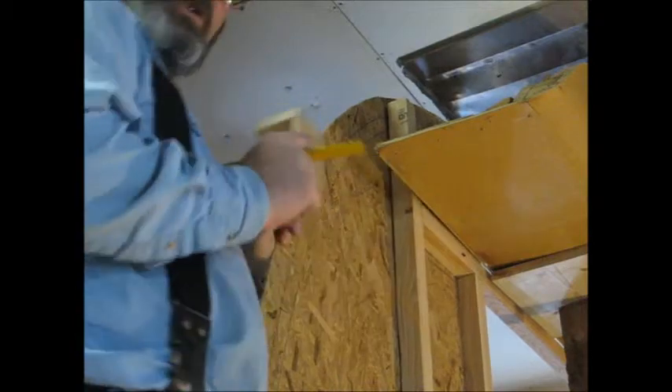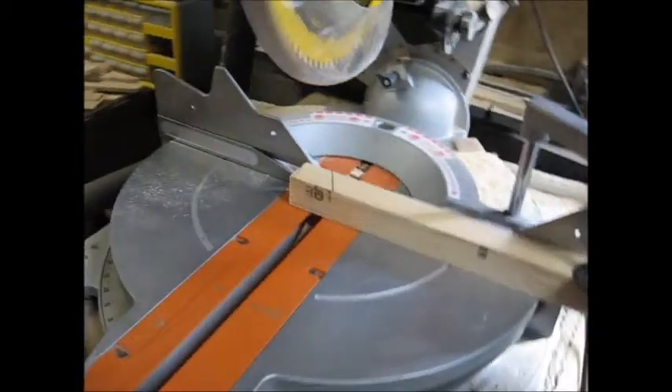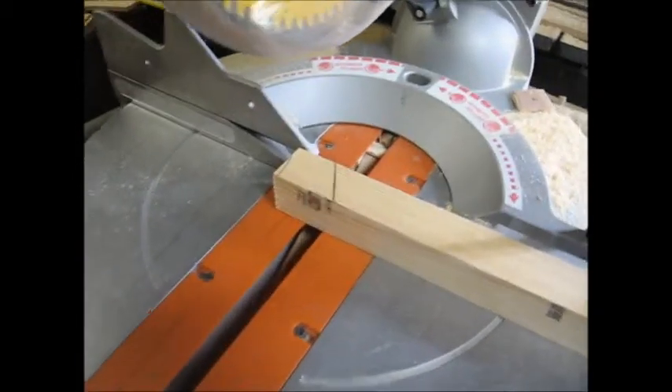I put this stud in — I just got it clamped into place temporarily. We'll mark this angle on here off our pattern, and we'll use this little scriber that I made. It could be in the far hole. I just slipped that on there just as easy as it could be. I'll get that cut off and then we'll get to screwing that back on. I thought I'd show you how I get the angles cut on these wall studs — there's my angle you can see.